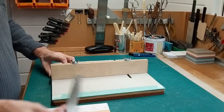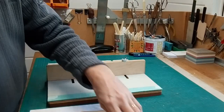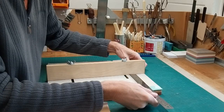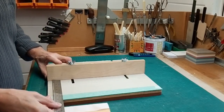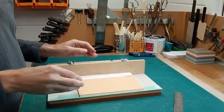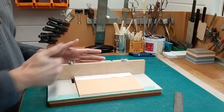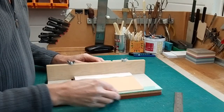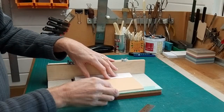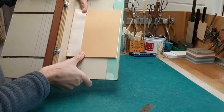So I'll just do that, tighten those up, double check the measurements. I know now that when that's going to be in there, not only is it cutting at 16.6 centimetres but it's also perfectly square as well, because it's cutting the same at both ends — I measured at both ends. So that's in the correct position, it's tightened up, and I'm now going to put this into the press and show you how to plough it.